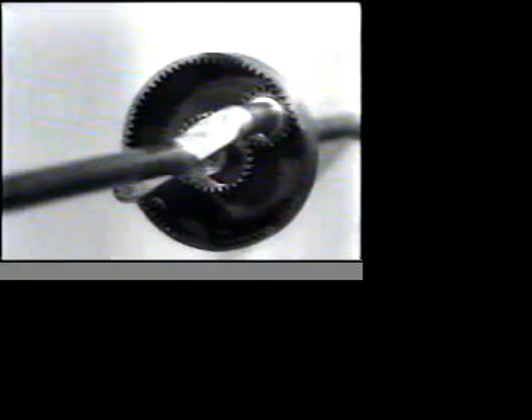A very simple model will show how one epicyclic gear train can affect a change of speed. First, there is a driving shaft on which a gear wheel called the sun pinion is fixed. Next comes the shaft we wish to drive with similar gear wheels called planet pinions, on a fork or carrier as it is called. These planets are not fixed to the carrier but can turn on their own axis. Now we'll add a toothed ring called an annulus. The sun pinion then turns the planet pinions, which in their turn rotate the annulus. There is still no movement being transmitted to the carrier.